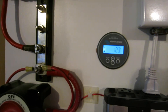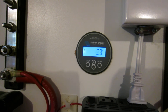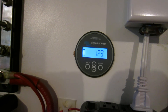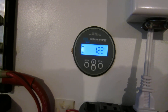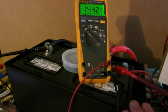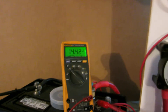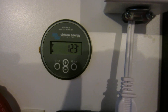Your monitor will remain more accurate as long as other parameters are properly set — such as Peukert's constant, the charge efficiency, and the average battery case temperature where your batteries are located. There are a lot of parameters that need to be programmed. Also, once a year if you have the ability, you'll want to capacity test your battery bank, because batteries are rarely at their rated capacity — they start to decline from the day you buy them.